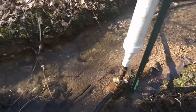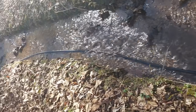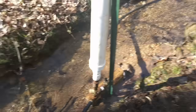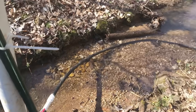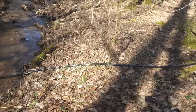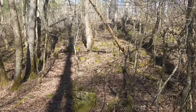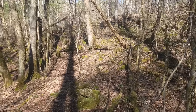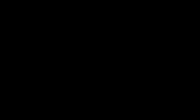The water is fed through this tube coming down the stream — it's only one-inch pipe. This is our test to make sure it works. On the back side, where the valve is, that's the outlet running up to the pond. I want to show you the length of the drive pipe — the incoming water. There's the pump, about 10 yards behind me, and we're going to follow this drive pipe all the way up to the head. There is my inlet — that is about 240 feet of pipe.